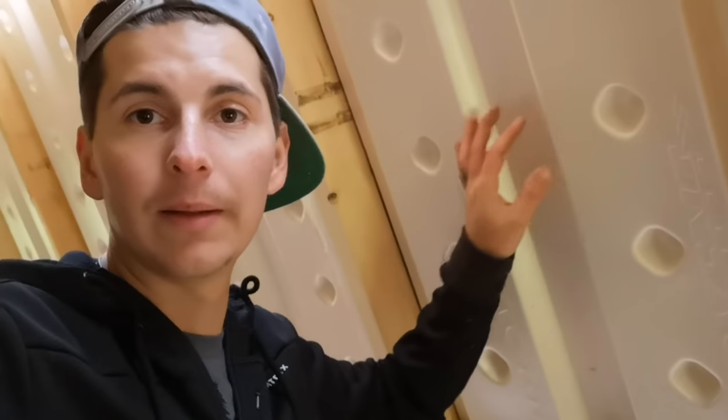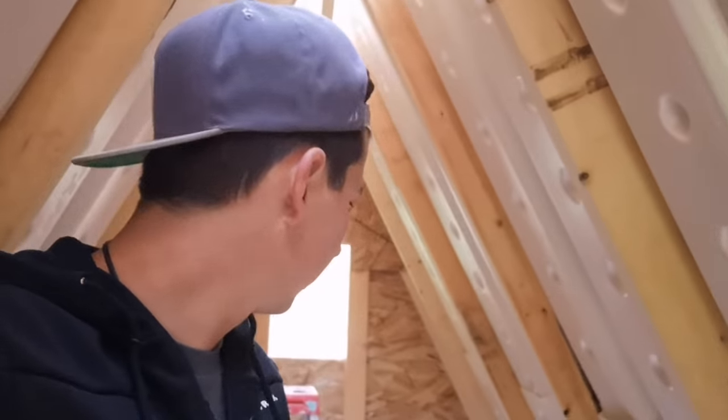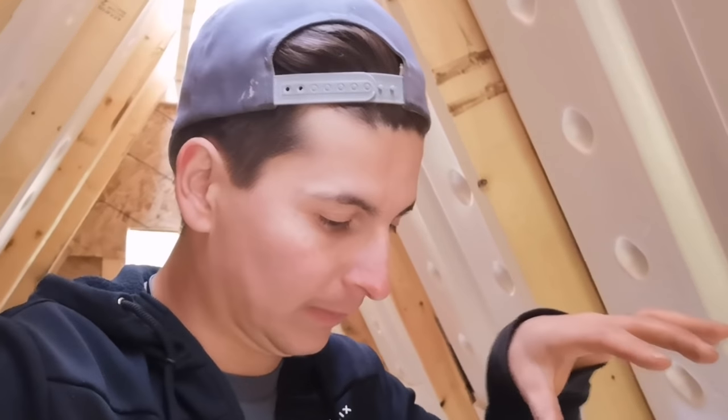I don't know. So now I'm going to put in the insulation, and I think we're going to be good. We're not doing a vapor barrier or anything in here because we don't want to trap the moisture inside. It's been recommended through various bits of research that Ashley's done that you don't want to vapor barrier your chicken coop. And oftentimes people say that you don't want to put a house wrap on your chicken coop either. We are putting one on ours, but we're not being super stingy with how we're vapor barriering everything. We just don't want it to get wet inside here so much.